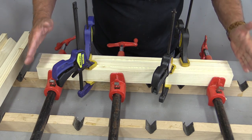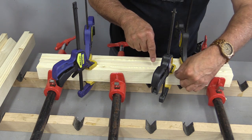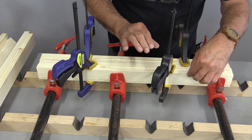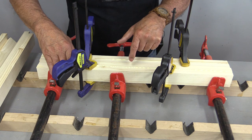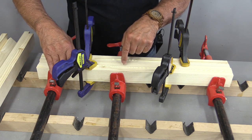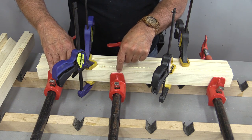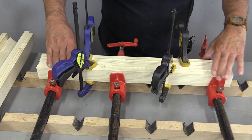There's all the gluing and clamping, and that wood is good and stable. I should mention the other reason that we sometimes glue wood — when we don't get the right wood, we have to glue it. But there's another reason you should always keep in mind: laminated wood, that is two boards glued together, are much stronger than a single board of the same thickness. So that's another really good reason why you might want to do some glue-up.